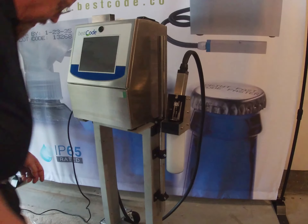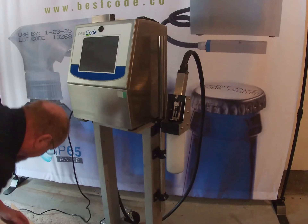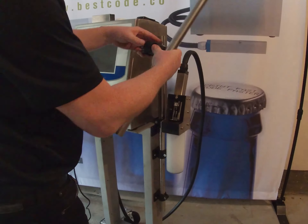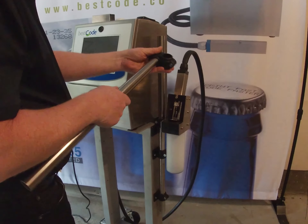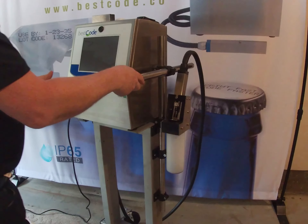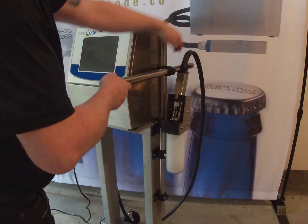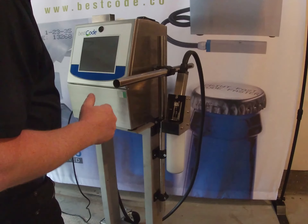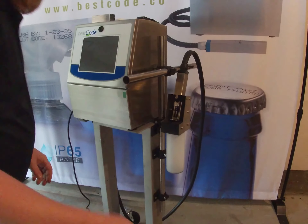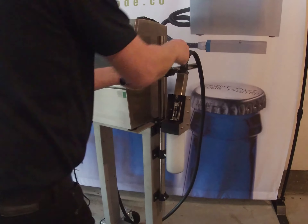Now that's in place, I can finish the side bracket off by mounting the short post. To do that I'm going to use the cross block — make sure you can get access to the Allen wrenches and that they're the right way around. For this application, I'm going to have the print head on the front with the keypad here. Normally the print head would be on the back, wheeled up against the production line with the print head on the conveyor belt, but for what I'm doing here I'll mount it on the front. I'll tighten this up and then tighten this one up.